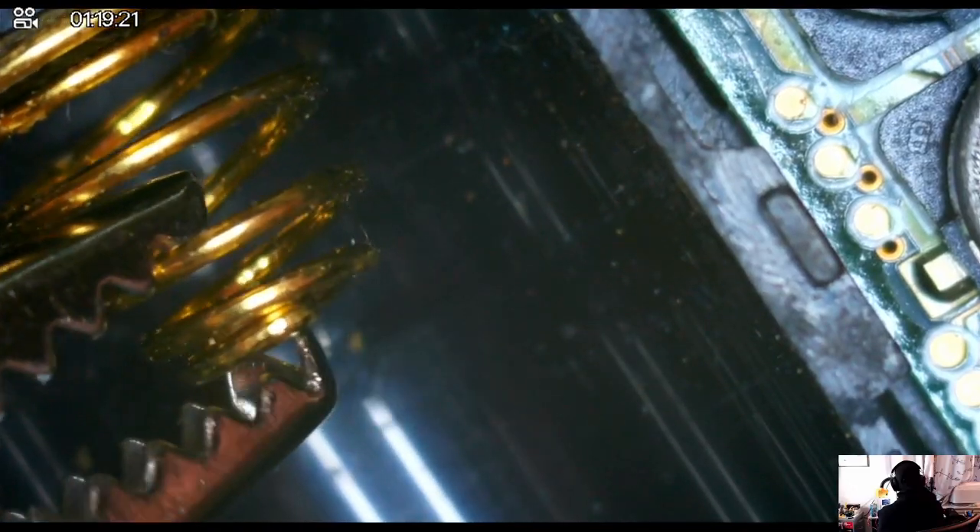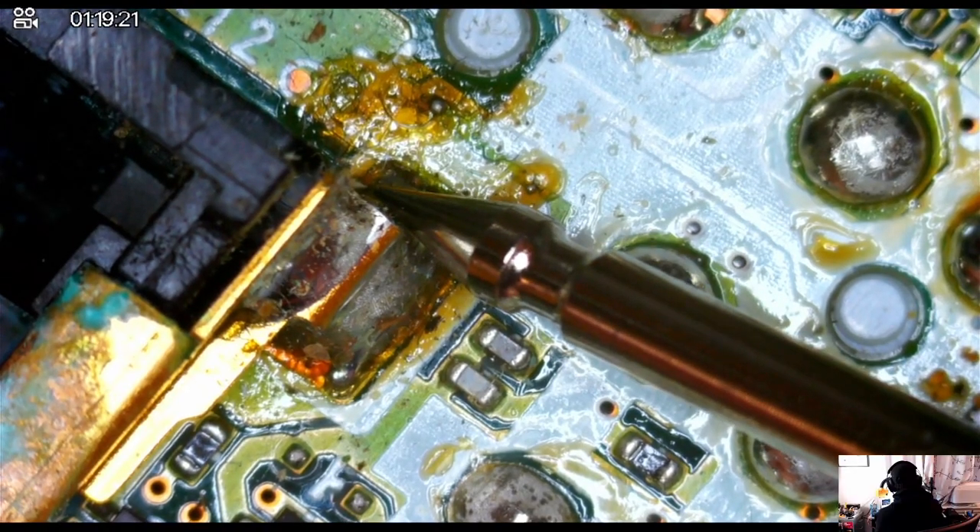At this point I'm going to try and test the terminals themselves. Here I'm going to ground, using a probe to inject voltage, and as you can tell at 1.5 volts the device actually works when you inject it directly into the terminal itself.